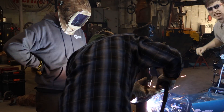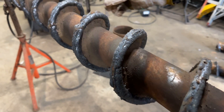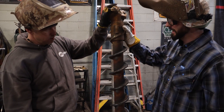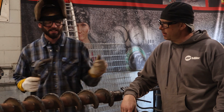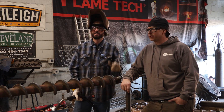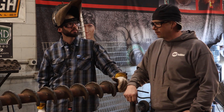Wrong gun angle — that's it. We didn't do anything different from one weld to the other except the gun angle we were working with. You can mitigate a lot of these issues if you just burn it in with a push angle. We put a lot of meat on this thing today — a lot of wire — this one's never going to wear out. Troubleshooting this metal core process hasn't been easy. We decided uphill was the way to go, but then we tried downhill again and that worked too. For me, metal core is a freaking enigma. It's labor-intensive and takes a long time, but MIG is still faster than stick welding for this application.